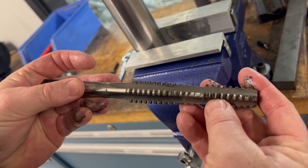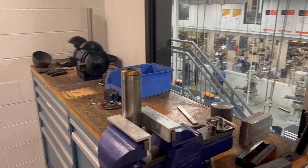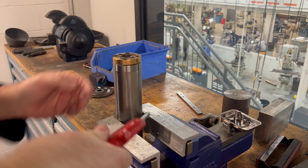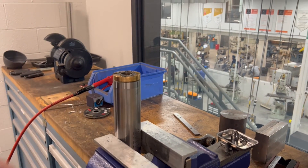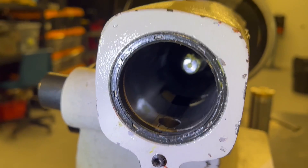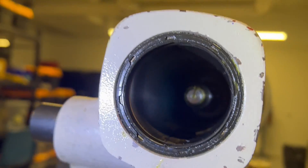There are virtually no cuttings on there — we're just correcting the threads. I'm going to blow it out. This is what the inside of the bore looks like, and this pin goes inside here from the bottom. It stops it from coming out.